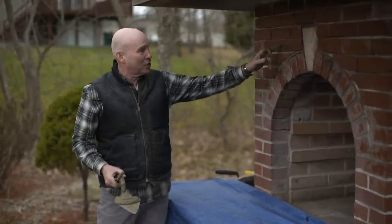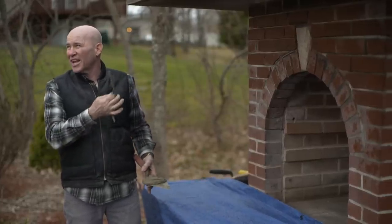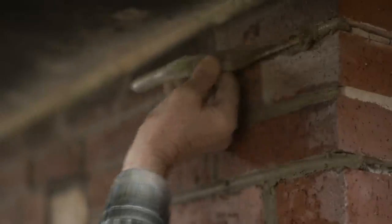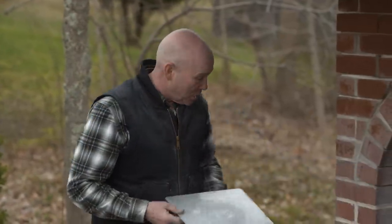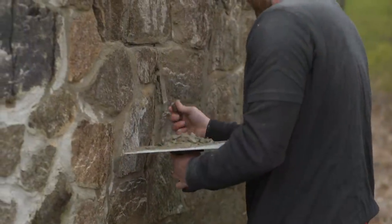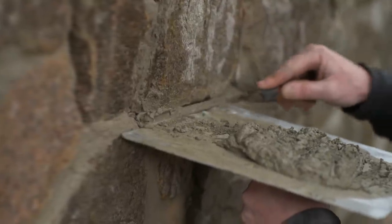First thing I'm going to do, Benjamin, is go for the head joints — make those flush. And then as I do my horizontal joints, the heads will already be filled in, so I'm just going to have to tap them to make sure they look good. What you're going to use out back is this hawk. Line it up with all those stone joints and take margin trowels of different sizes because we have such variation in those joints. Some joints are going to be fat, some are going to be this fat, and you may even use something this thin because you're going to want to push the mortar all the way back into the stone. Just make sure everything's full. As you bring the mortar out to the face of the stone, we'll come back and mimic the joints that someone else has already done, just to keep everything consistent.